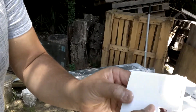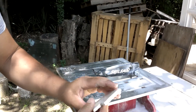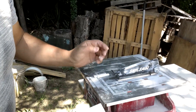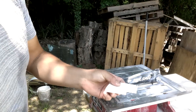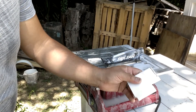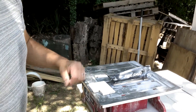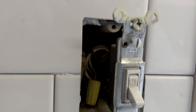If you're careful enough, you can do very tight, precise little cuts with this type of blade. The machine is not that expensive — you can keep it after your project or rent it. It helps a lot. For small chip cuts, there are also tile nippers or pliers you can use, though they're not as precise as the diamond wet saw.